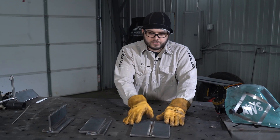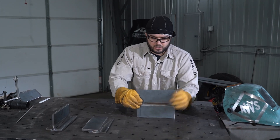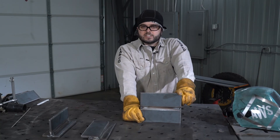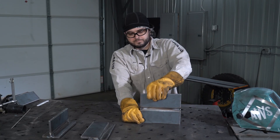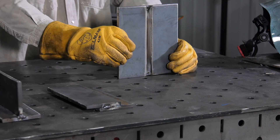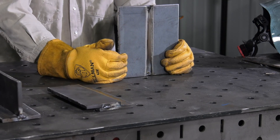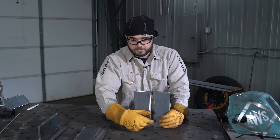The horizontal position: here we will be welding the material side to side. This position is identified with the number two. The vertical position is identified with the number three, and we will be welding either uphill or downhill.